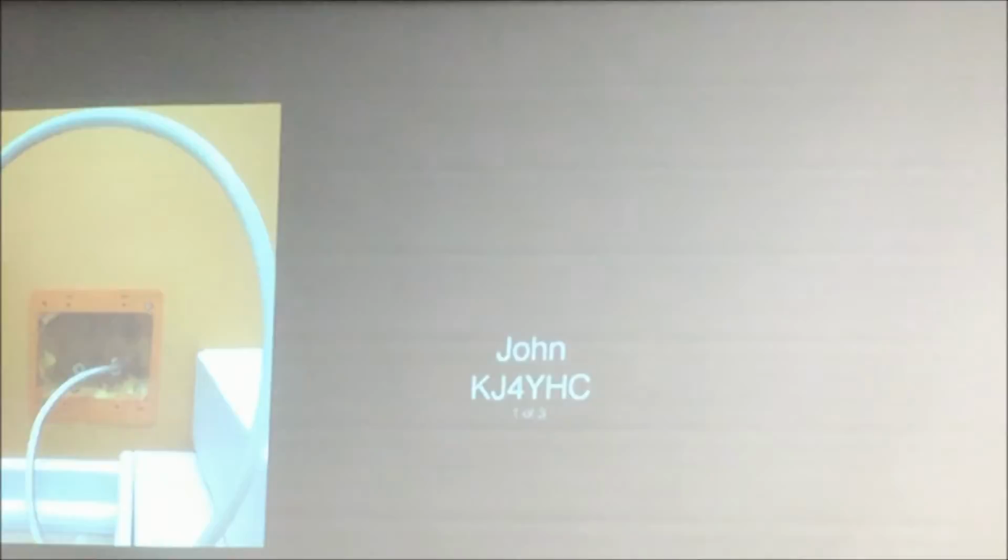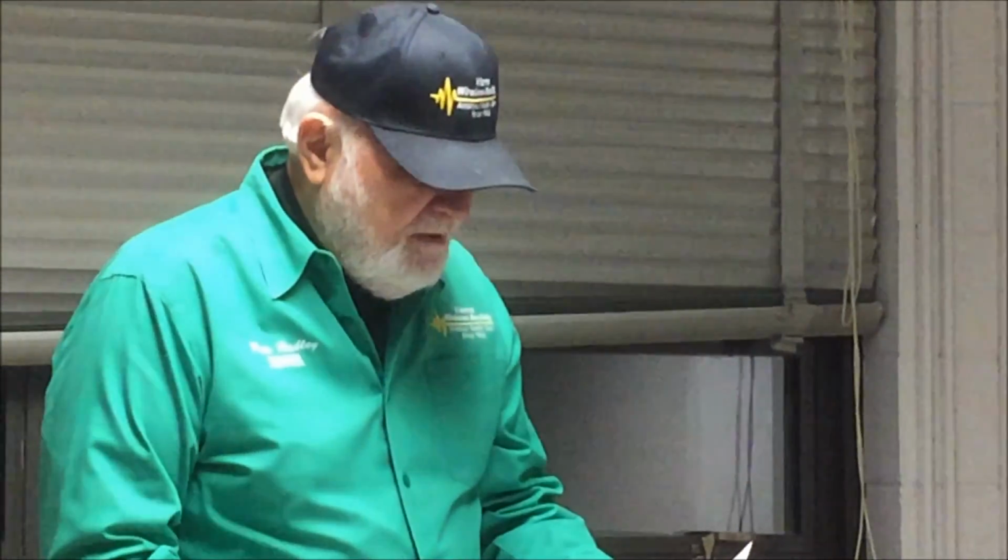Let me see if I can, I'm sure I made a copy of it. Okay, this is his description of the three pictures. From the inside, I cut the drywall and used a low voltage old work box to make it look neat. What is not shown is the duplex outlet cover I used to cover over the 4 coax. Inside the wall, I fitted cardboard around the opening in the wall space and used spray foam to seal it and give some R rating against the elements.